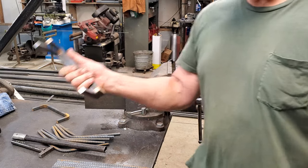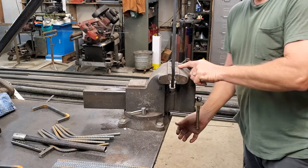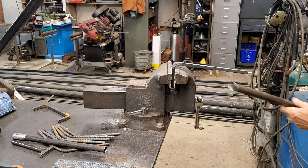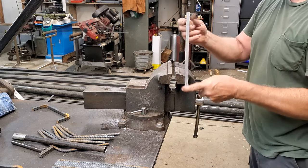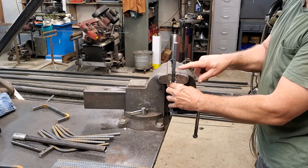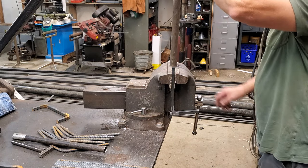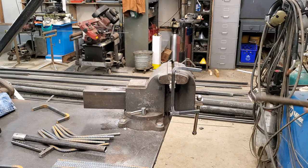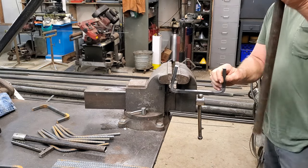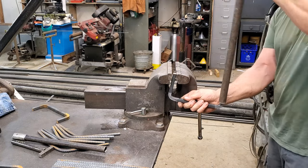These handles can be used for anything. Again, four inches on that line — first bend, put it on the line, drop straight down, dumping 190 pounds of pull on it. Then again I have to put it in offset by a half inch because of the thickness of the bar stock — that's just guessing that inch. If you work in a shop, you know. Drop that weight down. If it comes out crooked, just grab it and straighten it.